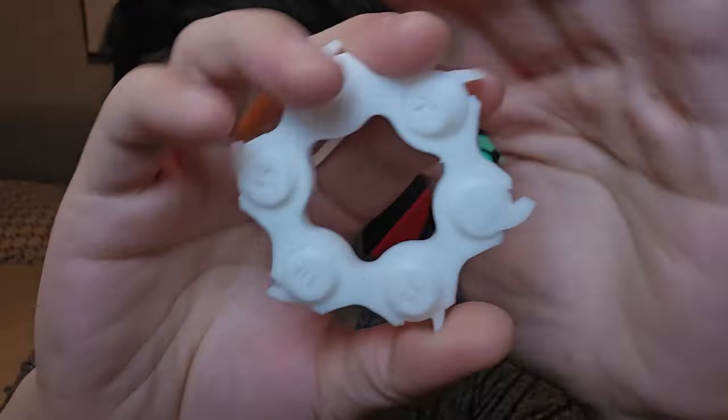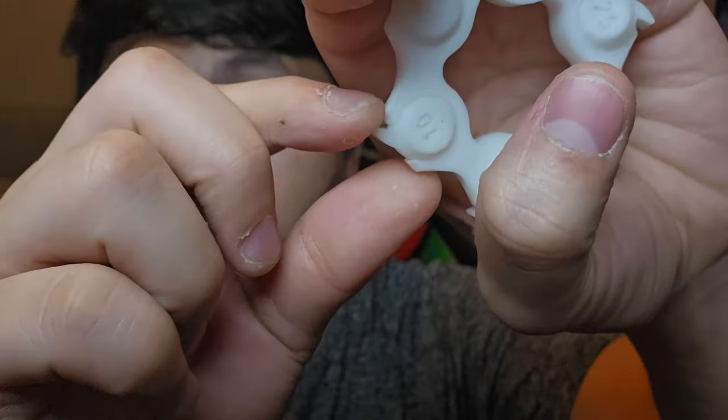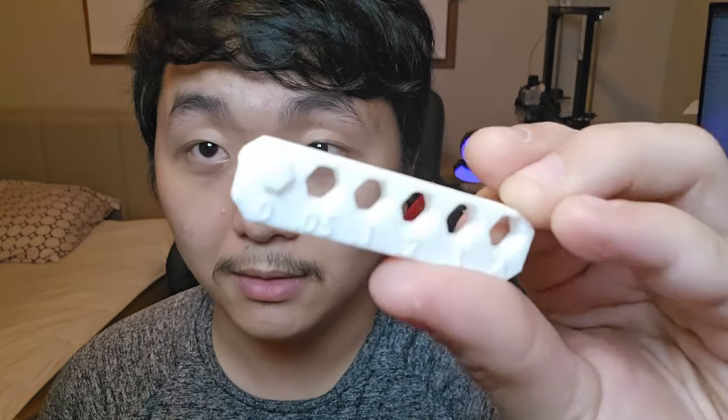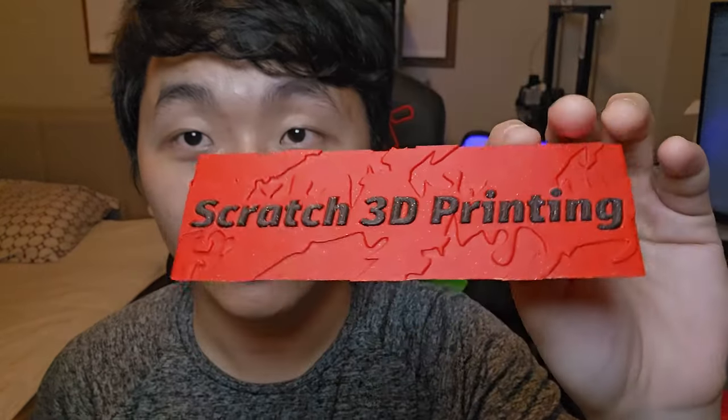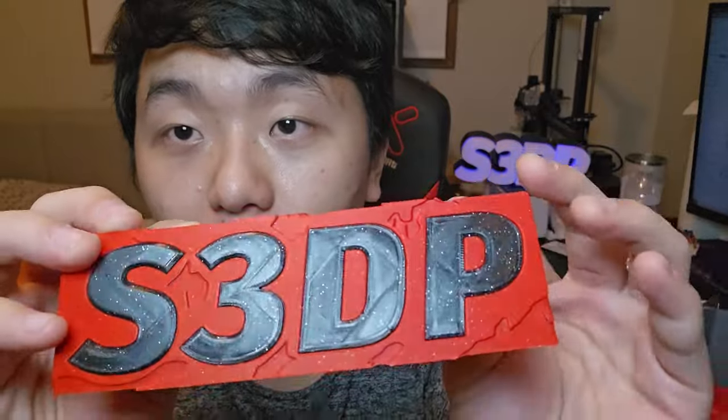Before I rooted the K1 Max I did a tolerance test too — at 0.15mm you could get it out, but at 0.1mm it was stuck. That was the very first week I had the printer using Creality Slicer and their profile. But after using Orca Slicer, rooting the K1 Max, and doing all the flow tests, pressure advance, and VFA tests, zero tolerance is now possible. The red ASA and black PLA pieces fit together perfectly at 0.1mm tolerance.